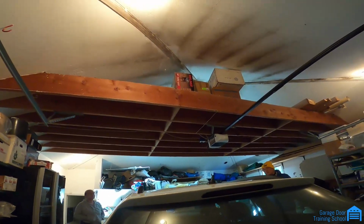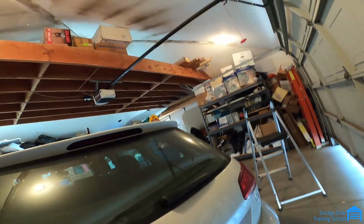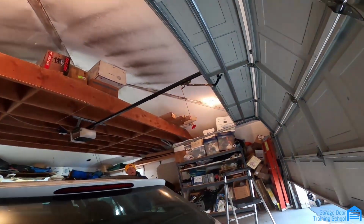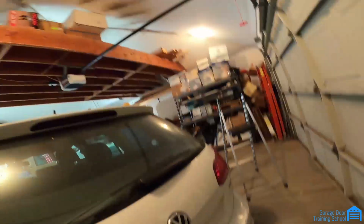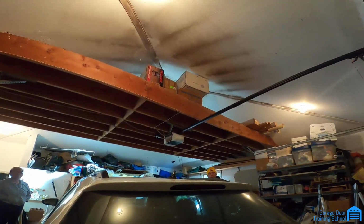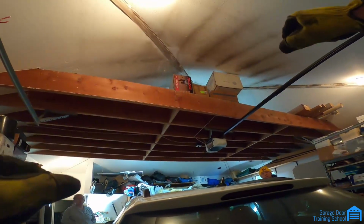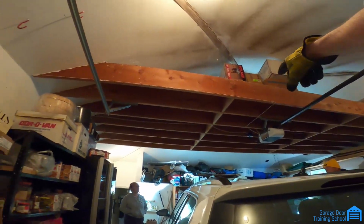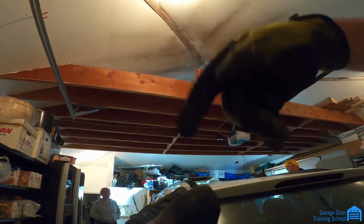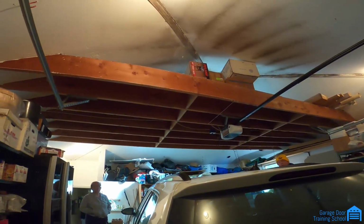So what I think's going on here is because if you use it by hand, it's smooth. I mean, it doesn't have that jerk. So it's not really in the door. If you run it with the opener right now, not connected, it doesn't have a load on it, so there's no way of me checking. It's either going to be because maybe you're using it for so long, it chipped away at the gear. There's a nylon one that's more common on the inside that wears down. And when that wears down, it might have even broke one of the teeth off of it.